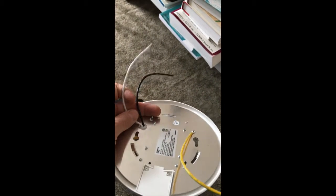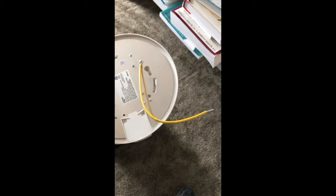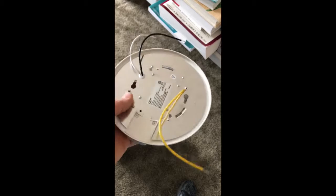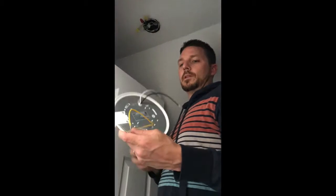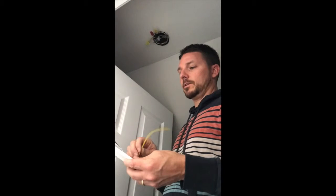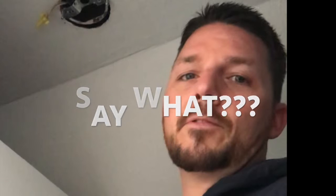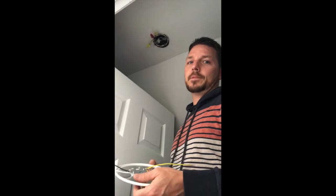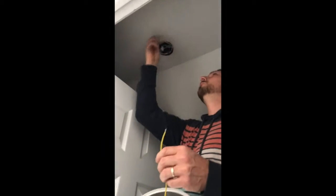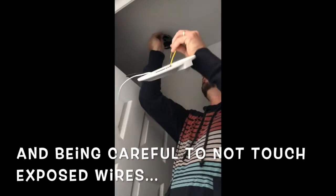On this one there's white and black, and then yellow — normally they're green wires but that's the ground. The previous fixture did not have a ground, so we'll see if I can ground this to the box. After looking back into the box, it actually does have a ground in there as well. Again, I'm doing this live — I know I'm gonna get some hate on that, but hey. Only working one wire at a time, I'll go ahead and thread the ground on.